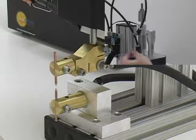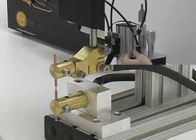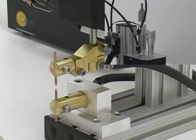The small valves on the air cylinder provide control over downstroke and upstroke speed. It may be helpful to slow the downstroke speed to prevent damage to small or sensitive parts.